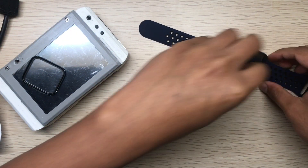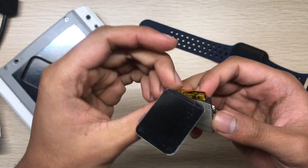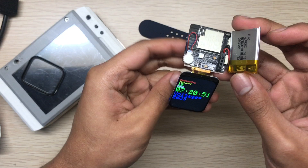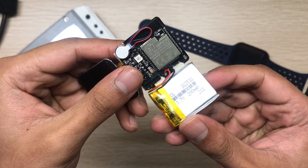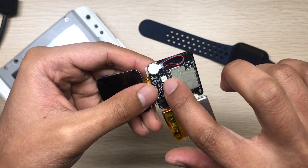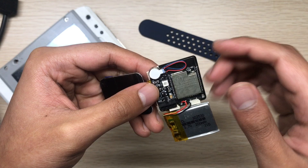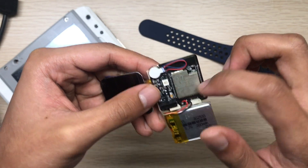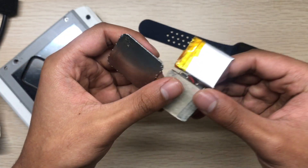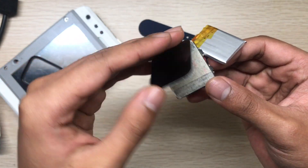This is the display here, and this is the 200 milliamp-hour battery. This is the ESP32, and this is the NeoPixel — it's not being used and I may remove it in the future. This is the vibration motor and this is the regulator. It's simple — there's not much soldering to do. I just used tape to isolate the display's back cover from the PCB.